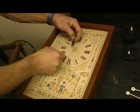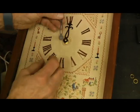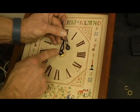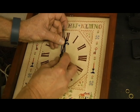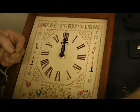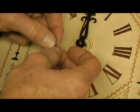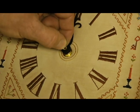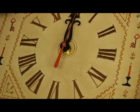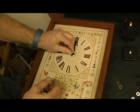We use the same hands. The hour hand presses on. The minute hand is held on — it just drops down. The minute hand has two flat sides, and the tip of the movement also has two flat sides, so you line those up and set it on there. There are two options for hand nuts. This clock didn't have a second hand, but it had an open nut. If you're using a second hand, go ahead and use that open nut, tighten it down, and then you can put a second hand on there — we sell second hands too. If you're not going to use a second hand, we'll give you a cap nut.